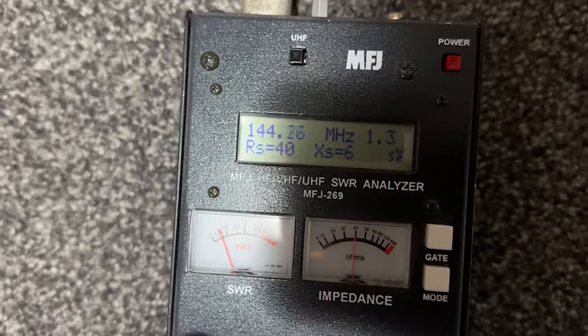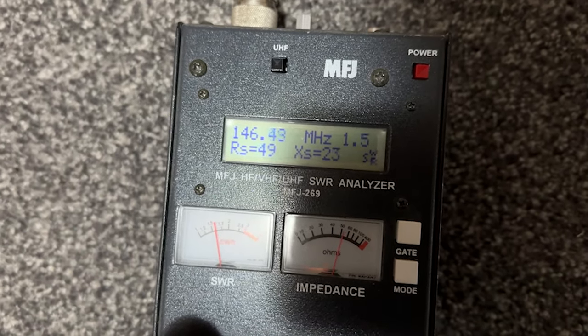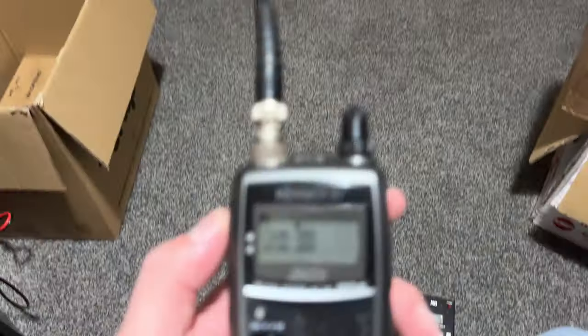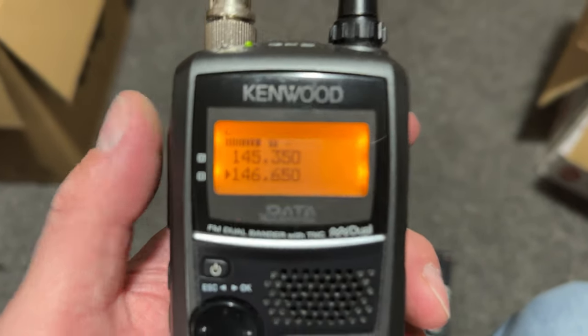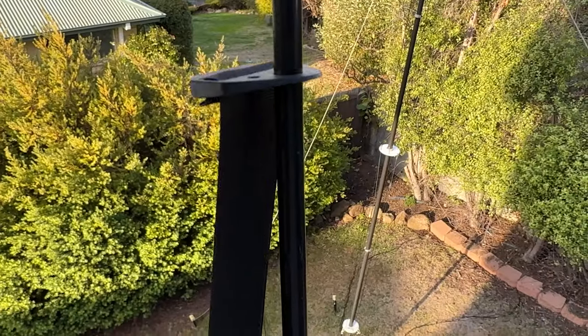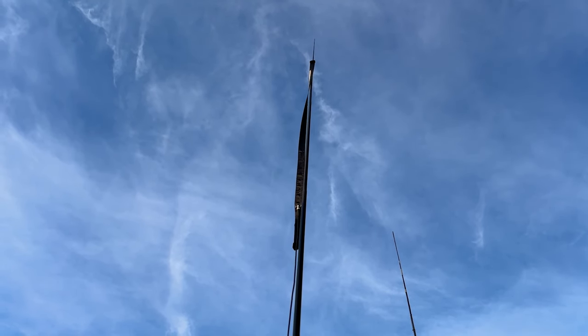This is a bit of a ridiculous test — I've just strung it up in the doorway here, with a little bit of coax into the analyzer. It's 1.3:1 at 144 MHz. If I go up a little bit to 146, around where our repeaters are, it's 1.6. That's not too bad just hanging in the shack doorway. I usually struggle to get into my repeaters from down here in the shack. With this hooked up, on the Kenwood it's full scale — S9. I've just hooked it on top of the DX Commander pole, straight over the top with a short length of coax.